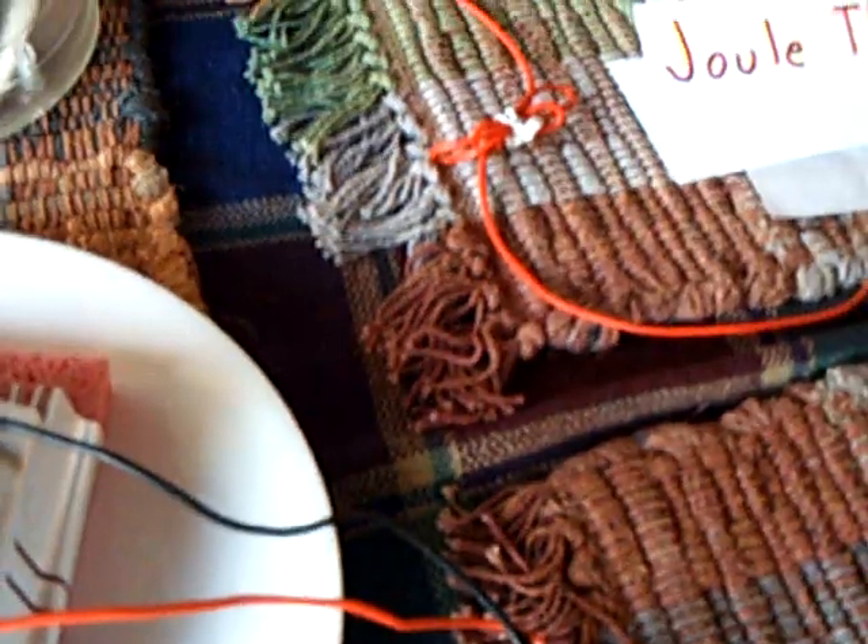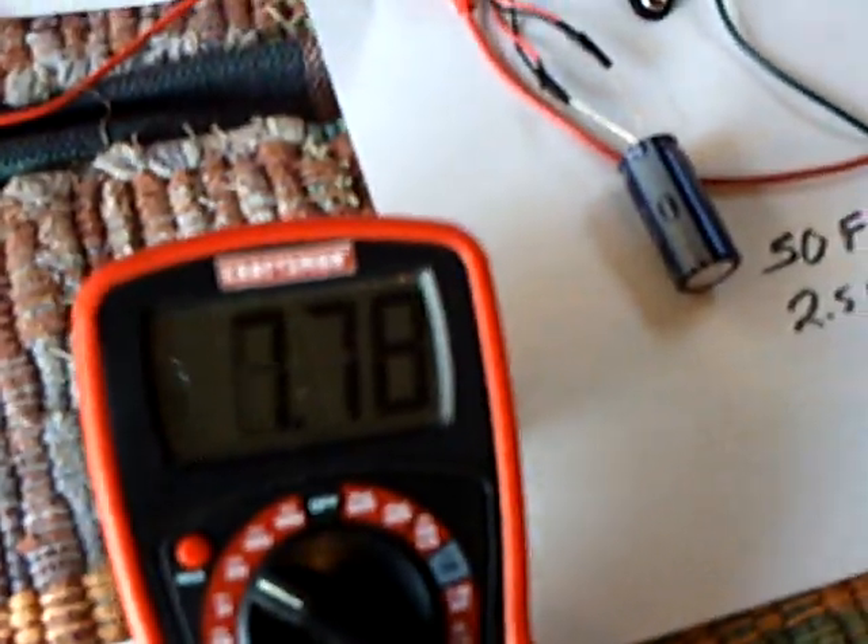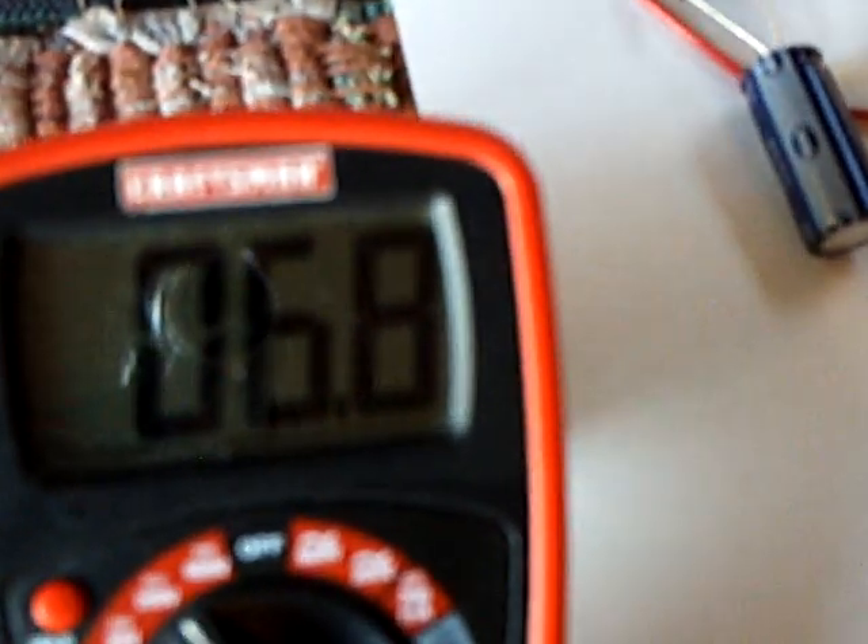I took this one step further with my little fluorescent light that I built. There's where the voltage is right now. I'm going to turn this on and place it on that filter — this went off scale. Now I'm at 6 volts with the fluorescent light making an induction system. Now I'm going to touch the bulb — it goes off scale again. That's 34 volts, on a 200 volt scale in the meter. That's 34 volts coming out of the filter, going through a bridge rectifier, and into that meter. That's without me touching it; this is with me touching it. So this was quite a find.